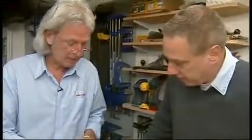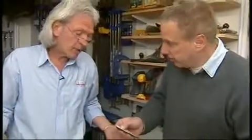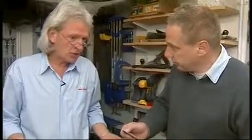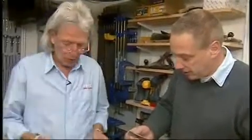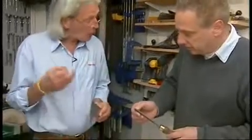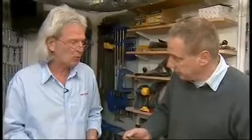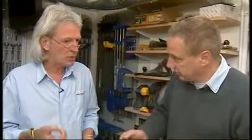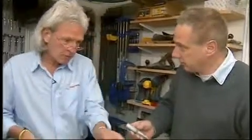So many professional woodturners in the UK are already using these because you can keep one in your shirt pocket. For woodturning I would suggest that the majority of the time you'd use the coarse side, because you need a coarse sharp edge - more like a wire edge. A very fine sharp edge would probably be too sharp for woodturning; that edge just disappears.